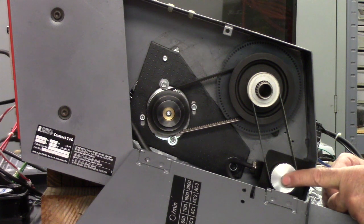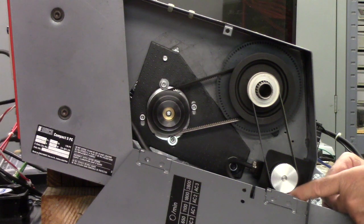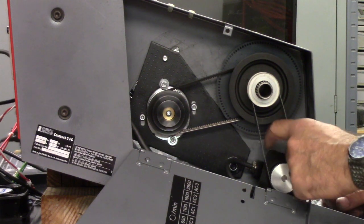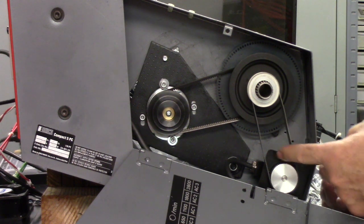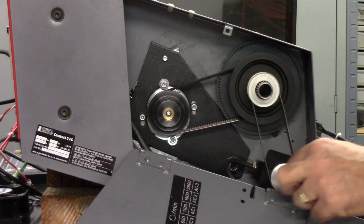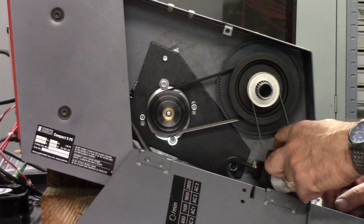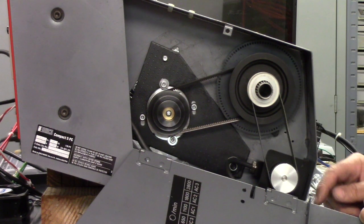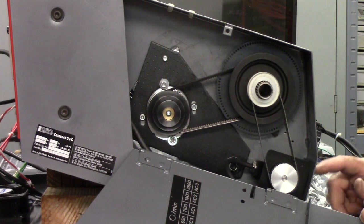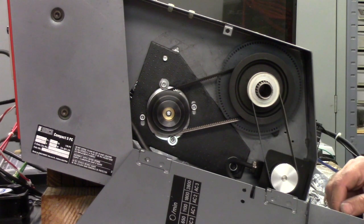A lesser, inexpensive encoder can't do this. You'd have to put up some sort of jack shaft arrangement. Also, the nice thing about this particular encoder from automationdirect.com is you can buy a mounting bracket, which worked out really well in this really tight spot. It's a right angle bracket that holds the encoder to the lathe and made things quite a bit easier. It was a little bit of a challenge to drill the mounting holes on the front here to secure it, but I managed to get it done. So that's the spindle side of things.